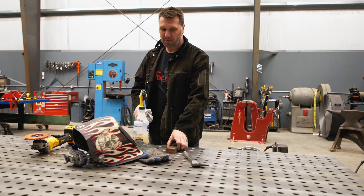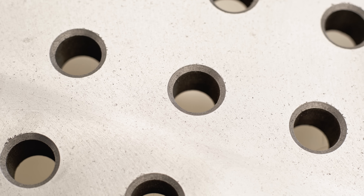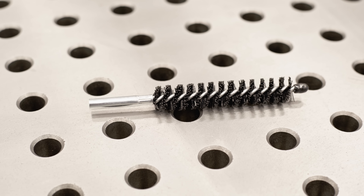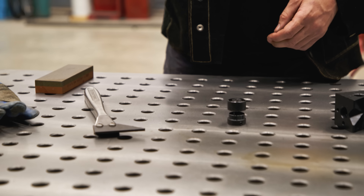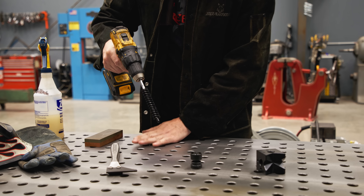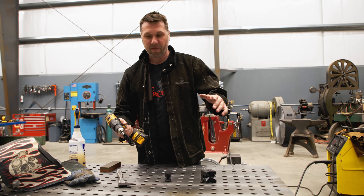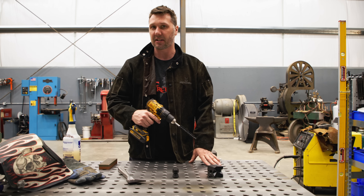The next thing is going to be the hole — the tooling might struggle going in the hole, and that's probably because there's dirt and grime inside of them. That's just natural from actually doing work. Here's a little plastic wire brush — you can do it with your hand to clean the bore, or I like to put this in a drill and just turn it on and go from hole to hole. It's something you're going to have to do periodically, but it makes quick work out of it. Within five or ten minutes, you can have the whole entire table done.